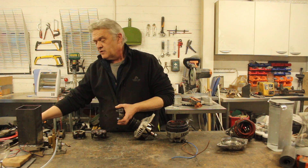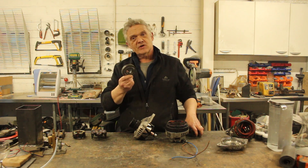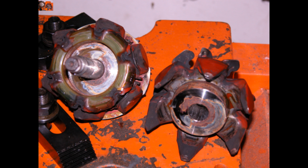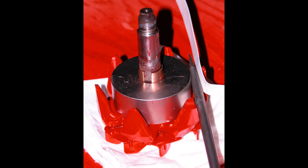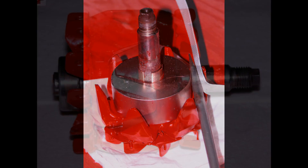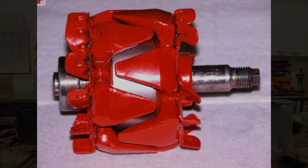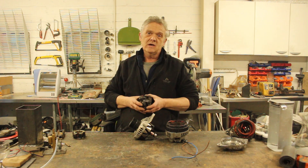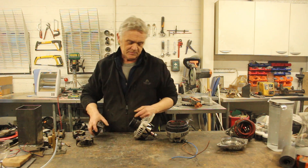Just like in the previous video, we can use a speaker magnet that has a north face here and a south face here. The crab claws will bend those poles around, so even though that magnet has its top north and top south, it makes no difference — it'll bend around so that we get north and south on the poles where we want them, because the crab claw is bending the magnetic field. That's absolutely awesome.